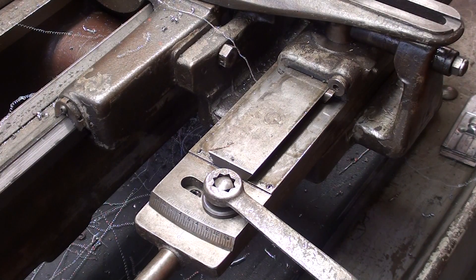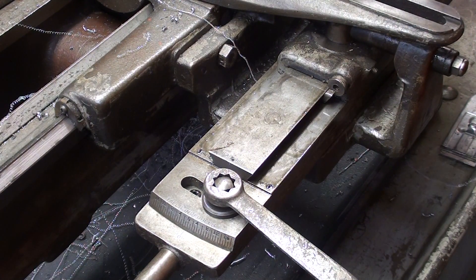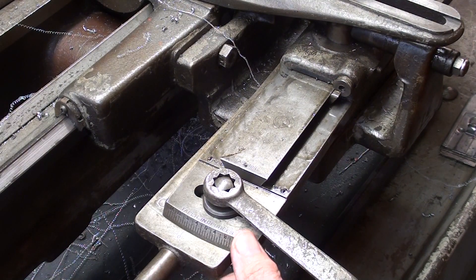This is the second day of filming, and it is possible I will repeat myself — I don't mean to. I want to cut a ten-degree taper of indeterminate length on a piece of one and one-sixteenth inch stock. Because this isn't a project, it's strictly an exercise, so I'm going to start out by setting the swivel bar for ten degrees.